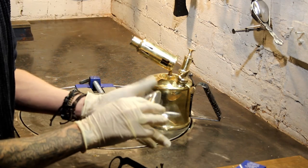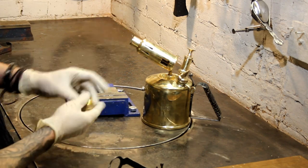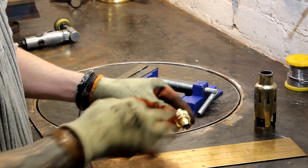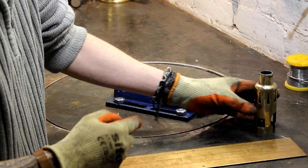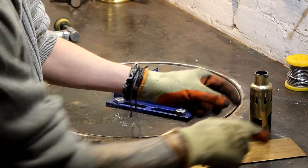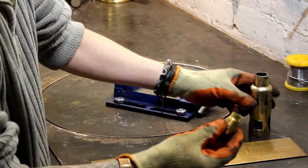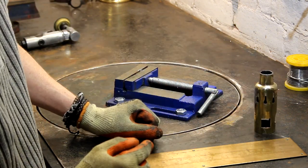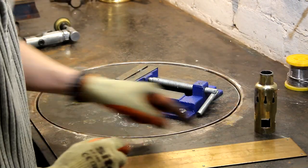What I've got to do is find a way to mount this bulb holder inside here. I've got this bit of old brass plate — I'm going to make a brass washer out of this, cut a hole in it, solder this ring to it, and then solder this brass washer inside the chamfer. Then I can take the bulb fitting, slot it in, screw it in, and that should give me a nice fitting to put the bulb into.